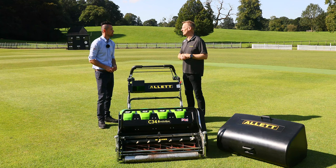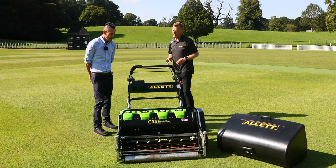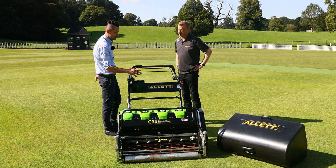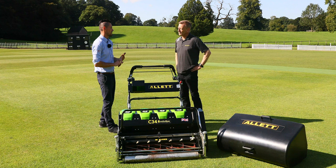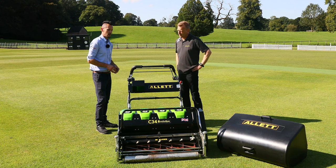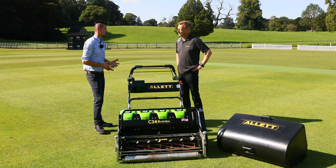Talk to me about the speed controls on the cylinders. So we've got two speed options — fast and slow — very effective in adjusting the speed for the cylinder, giving you a varied clip rate between 95 and 195 clips per metre. But also when you are doing other options such as a scarifier or a turf rake, it also varies the speed of that, so you can be more or less aggressive. Also in wet conditions, you can adjust how you throw into the box, depending on what the conditions are like that day.